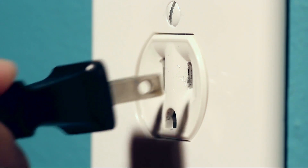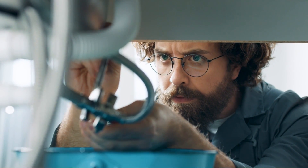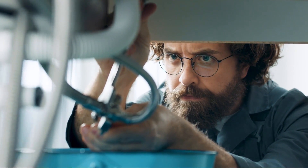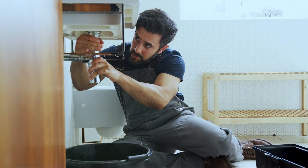Unsuccessful plumbing repairs are one of the most common DIY mistakes. Even minor repairs like pipe leaks can lead to mold and rot when done incorrectly, and that can create much more expensive repairs down the line. If you suspect a leak in your sink, make sure to check that your drainage joints are watertight. You can place a paper towel below the sink, wait an hour, and you'll be able to see if there's a leak.